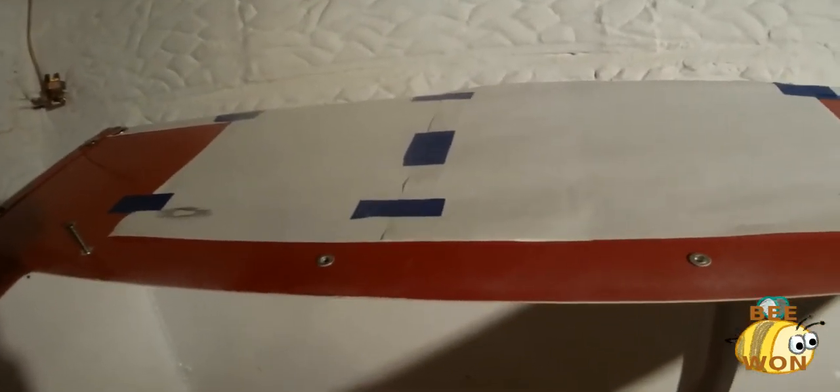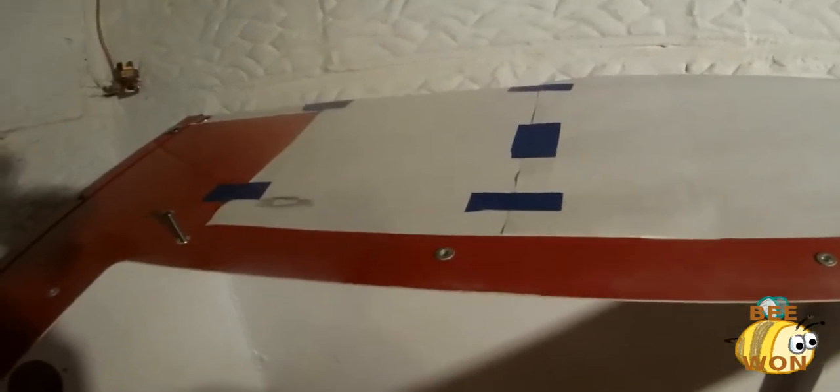Just about got this cabinet done — I'm just touching up some things. I made a cart and the paint's drying on it so I can wheel it around if I need to. I'm painting the corners where I had this black polyurethane sealer on there, so that the blast media will slide down easier. The polyurethane is a little gummy so the media might want to stick.